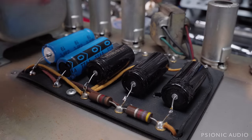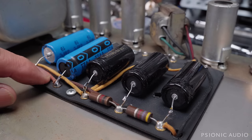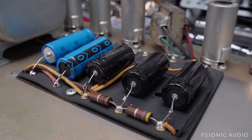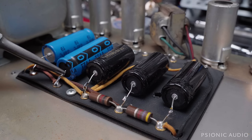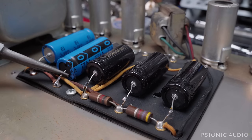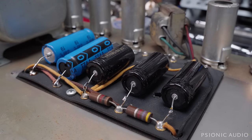This is acceptable as an emergency fix — it's nothing to be proud of, and there's no silicone holding them in place, so all the stress is on the leads. A lot of times on caps, if there's any stress they'll break right where the lead joins the body of the cap. This one has a really long lead on one side and is really short on the other. When you do have to J-hook, use some kind of heat sinking when soldering so the heat doesn't go right into the cap body. This is a C-grade cap job, and I think this amp deserves an A-plus grade cap job — so that's what it's going to get.